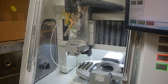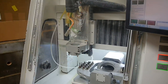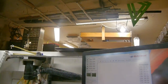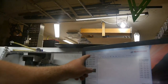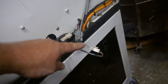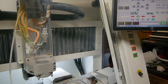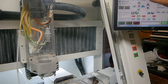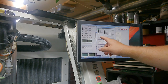Interesting. Did that home to the back corner last time? It hit the limit switch. It's almost like it went the wrong way. Is it because I messed with the machine coordinates? Because Y should go to zero. So, I accidentally brushed against that and unhooked it. So that's why my homing wasn't working. It works! It works! Alright, let's just rehome all the axes.